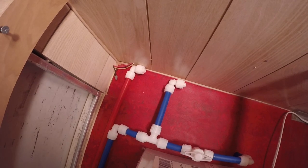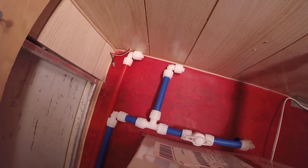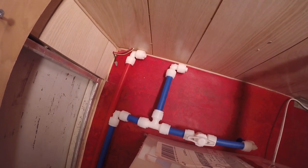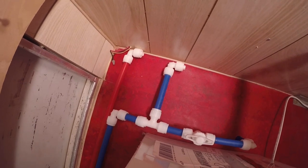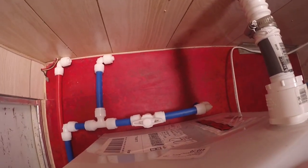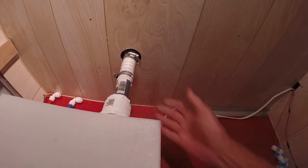The thing I really like about this system is it's very simple and easy — you don't have to worry about leaks, just follow the directions that come with the connectors. You use a heat gun to soften up the end of the PEX, slide it in, and use the compression fitting. I also like that they have blue and red pipe, so it separates your cold water from your hot water, making installation and repairs much easier than with copper tubing.